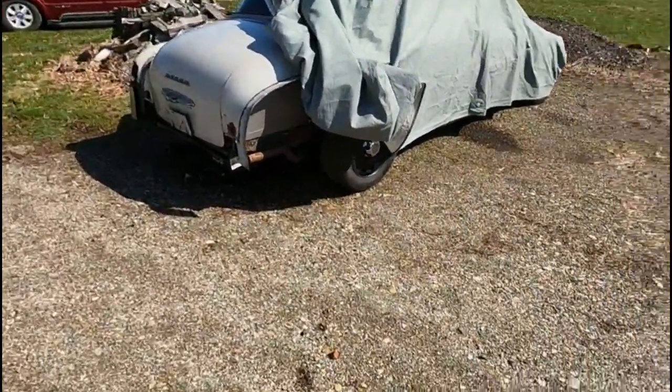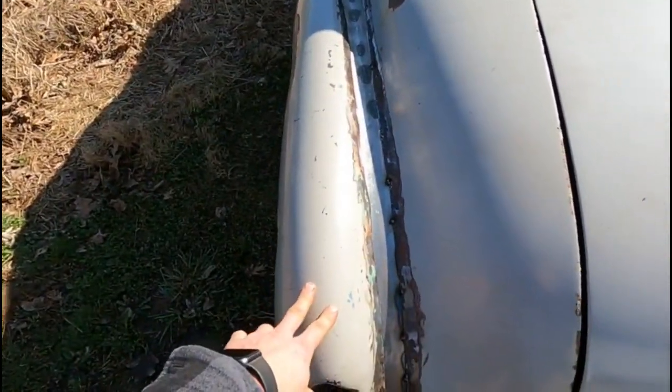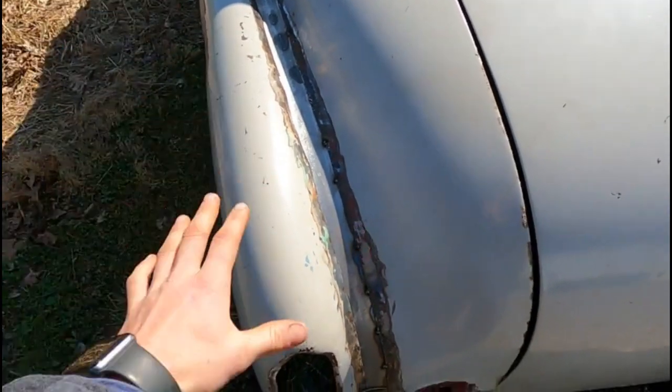I am rethinking the rear fender just a little bit. And the reason is, obviously I've been building the fenders and everything around the current Crown Vic wheels that I've got. However, I'm rethinking that idea a little bit. I may be getting a new wheel, just maybe one for now, so I can do some mock-up. And it's both a bigger and a wider wheel. And the reason that I may do it at the moment, obviously the fender is not finalized at this point. I can still move it out where I want and change it for the time being.